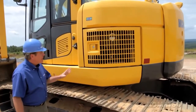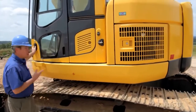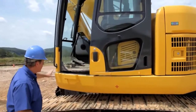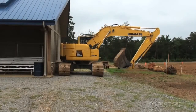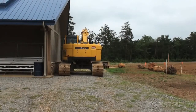The other feature that makes this a true tight tail is the contoured cab design and the sliding convex door. You can see the cab is rounded in the front, not like a conventional cab, which allows the front of the machine to turn in the same swing radius as the counterweight. So if there's a truck parked right behind you, you can still swing and load it.